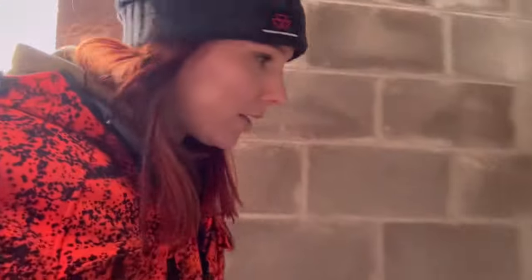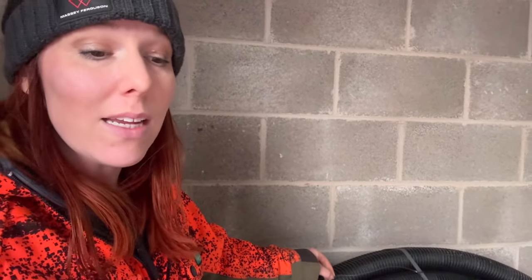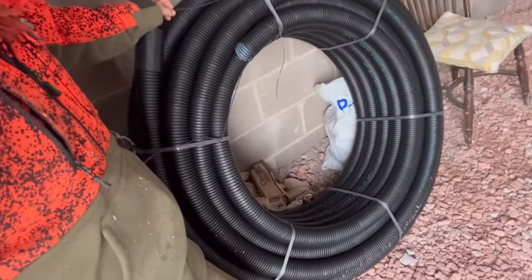I've lost it. I haven't lost it. It's in here. So this here is for the communications cable. It's funny how all these little things pop up, but you don't realise to start with that you're going to need them. So the communication system cannot run within a metre of the electrical system. The ducts that have the electric in cannot carry the communications cables because the pulsing in the electric interferes with these. So it now has its own duct.